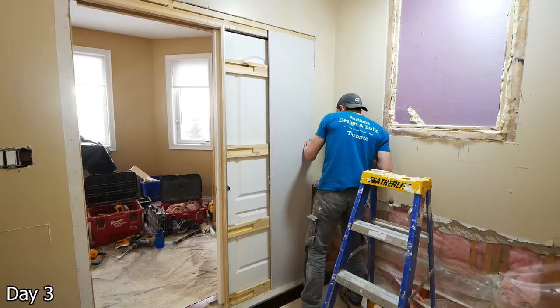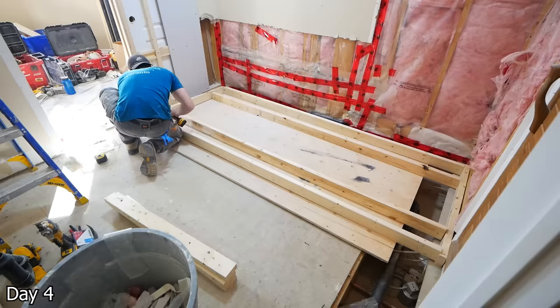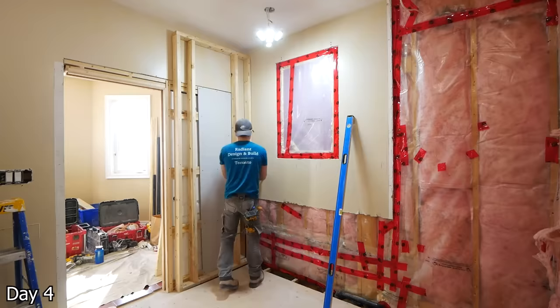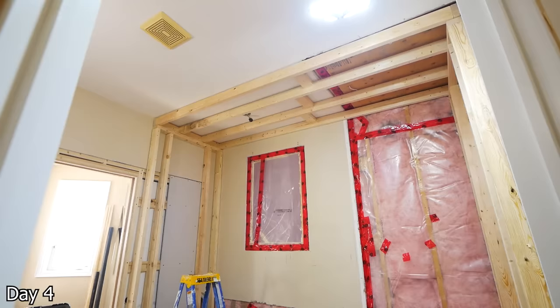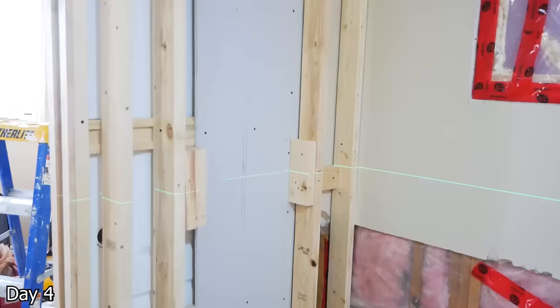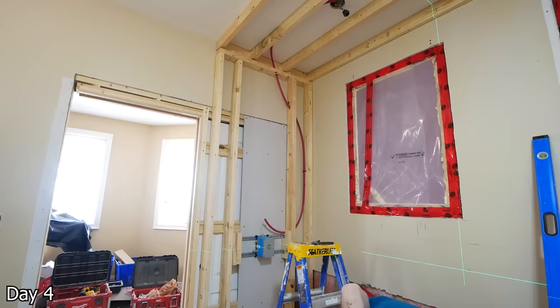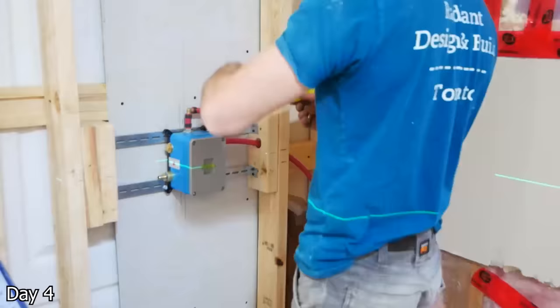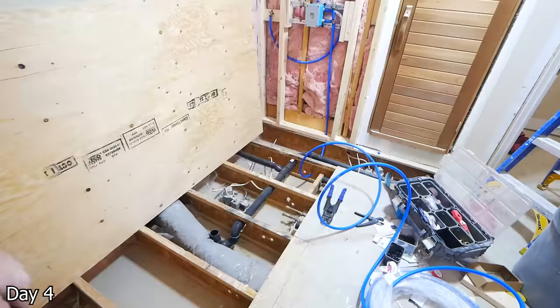I would eventually be adding a wall in front of this one, so before doing that I just installed a piece of drywall and some wood strips to add a little rigidity to the pocket door. And then framing out some new walls as well as a new ceiling for the little shower area. The reason for the wall specifically was to house both the plumbing as well as the niches. And then for the ceiling, dropping it down because we're going to do some recessed rain heads — it's just going to make it a lot easier to drop it down and have a perfectly flat ceiling, so for our large format tile we can get a really nice bond. And then roughing in the shower controls — these are by Tenzo — using a laser to keep them perfect with one another. Running water up to the rain head as well as the handheld, and actually using hammer arresters on both the cold and hot supply lines just to reduce any noise with the sudden shutoff and turning on of the water.